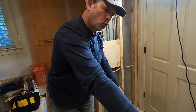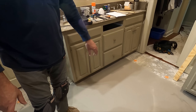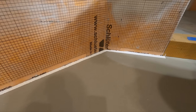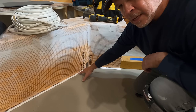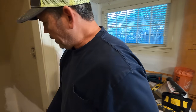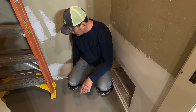I got in here earlier. I removed the foam dams at each doorway. I also used my buzz saw and just went around the edges and cut off the foam. We had several comments about whether or not I'm going to leave this. Right here, I'm going to remove it and fill that with thinset — a lot of people recommended that. But over here in the toilet area, we're going to have baseboard and shoe and it will cover it, so I'll probably just leave it.